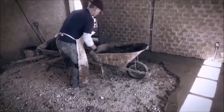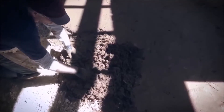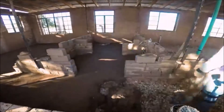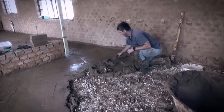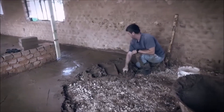We've got our earthen material here — the same material we used to make our blocks. We've got Tim White, who's the expert in Texas on earthen floors, using a wooden trowel to put it on nice and flat. This is the base coat — we're not trying to make it perfect. It's three inches thick and it's going to take two weeks to dry. It's as simple as mixing some mud and just mashing it into place and troweling it down flat.